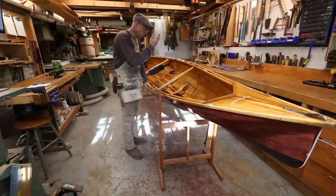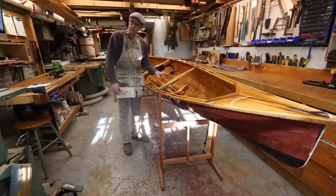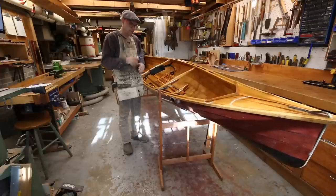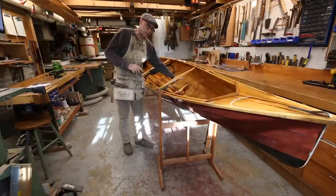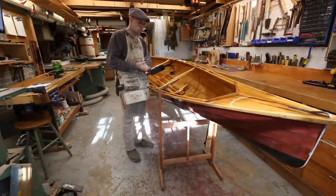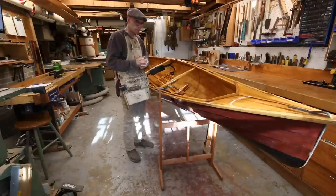On the inside I've used plain untinted varnish — I believe I was using Sikkens products at the time and they've held up very well. However there is some degradation happening in here now. The number one rule about varnish is you revarnish before it looks like it needs revarnishing — if it starts getting a little bit dull, that's the time to revarnish. Don't wait until that varnish is breaking down and peeling off, because at that point you've already lost the game.